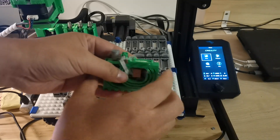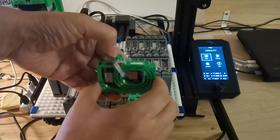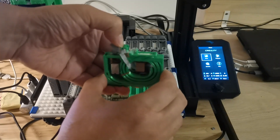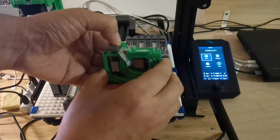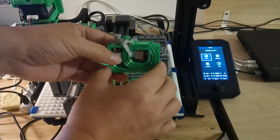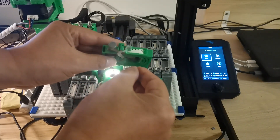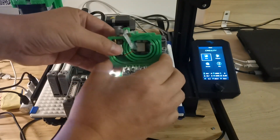Right now you can see there is a flashing light here — that means it is in setup mode. I also support two millimeter pitch and four millimeter pitch modes. You can click the small button and switch between them. A slow flash means four millimeter pitch, and a fast flash means two millimeter pitch. In this way it will be able to support 0201 components, which use two millimeter pitch, and also components that use four millimeter pitch.